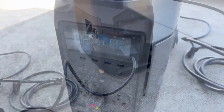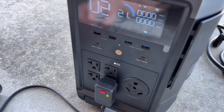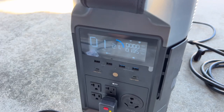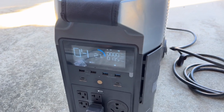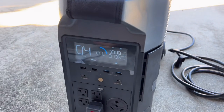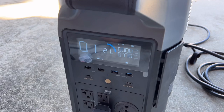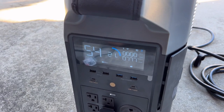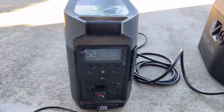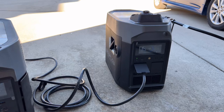I took my time setting this up — the generator has been sitting for about 20 minutes while I got the Delta Pro set up. It's at about 21% and I have it set to turn on the generator at 20%, so when it discharges to that level it should automatically start. I've got the hair dryer plugged in to discharge it. Hopefully the generator starts like it should after sitting for a while.